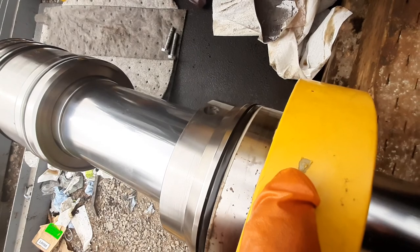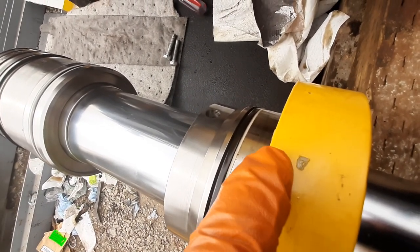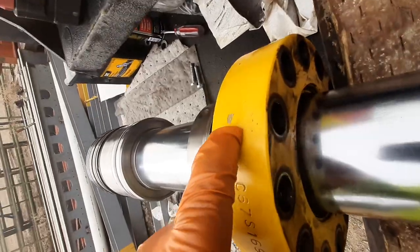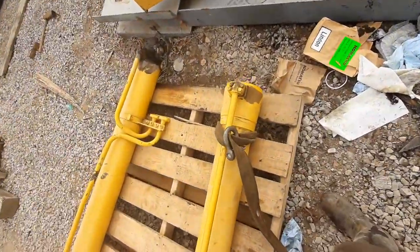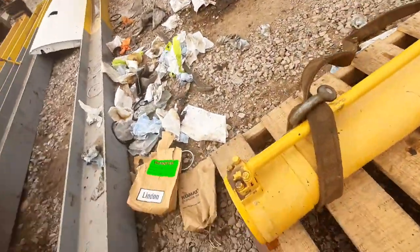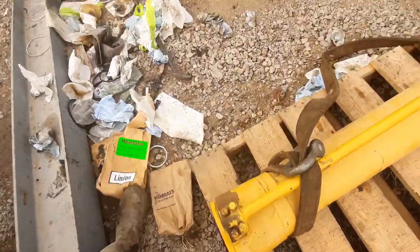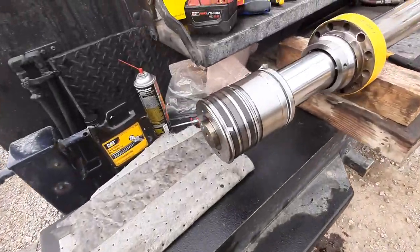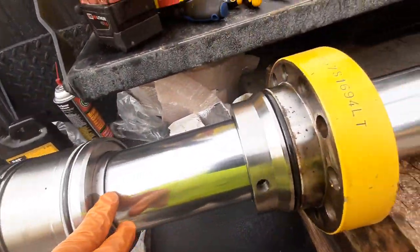This is an arm cylinder, so I'll stamp a letter or put a stamp on one of these guiding holes so I can get my hydraulic cylinder and rod to line up after reassembly. After marking it, come here, split it apart, and move it back.